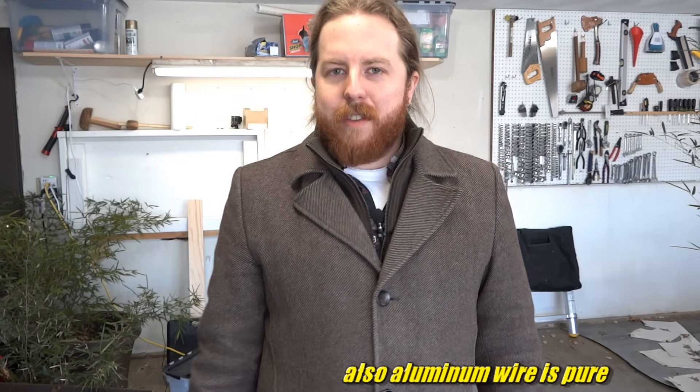So half the weight or so is like plastic — it's not even aluminum. So I'm gonna show you how to melt it to minimize the loss of aluminum. The aluminum will get caught up in the dross, the crud left behind, so we gotta get the most amount of that aluminum off the dross. We don't want to lose it to oxidation because once it oxidizes it's gone forever. The problem with the metal is that it's fairly pure. Cans are fairly pure. Extruded aluminum like heat sinks — that's fairly pure. Sheet aluminum is usually fairly pure.